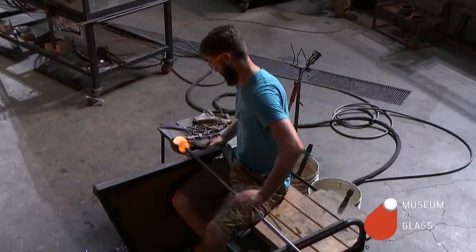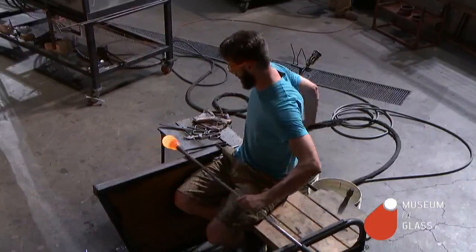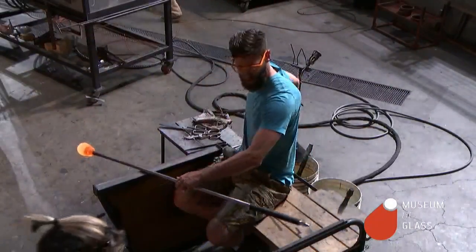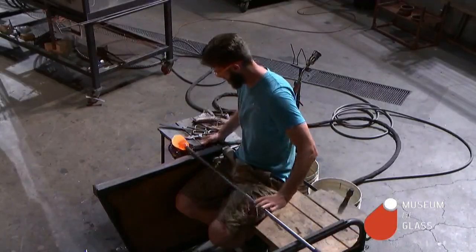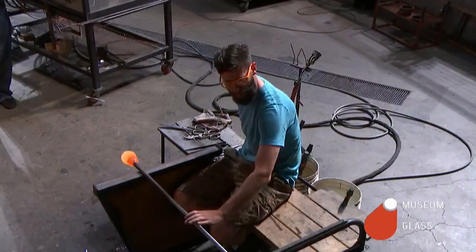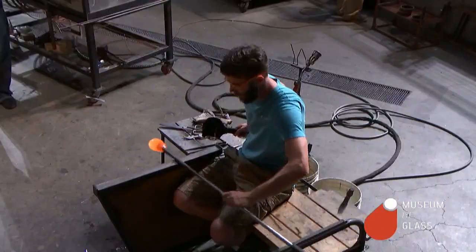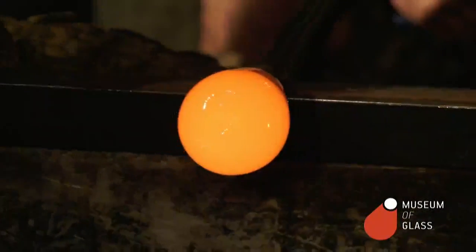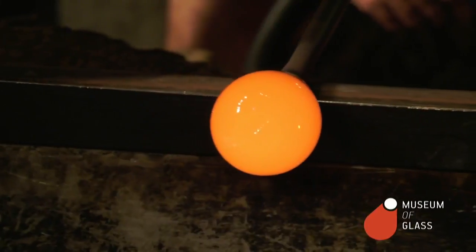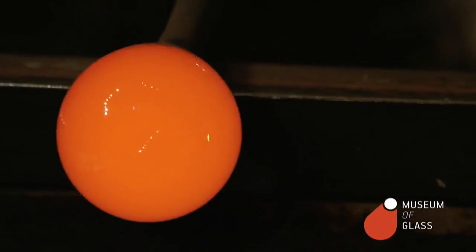Buy colored glass separately and form a bar. We heat up a little chunk of colored glass and we melt the layer of colored glass over the clear. We buy our colored glass in the form of these bars. We buy it like an artist buys paint: red, yellow, blue, pink. Cut off a chunk of whatever color, we heat it up in that round oven, we blow a bubble of clear glass, and then put a big blob on there, and then push it back till it coats the original bubble.